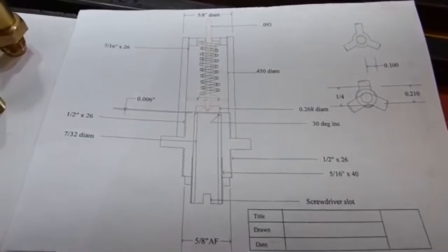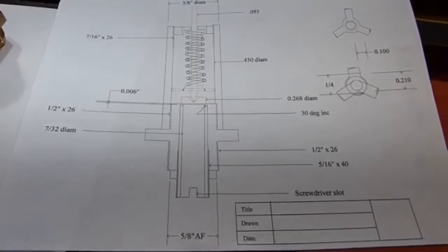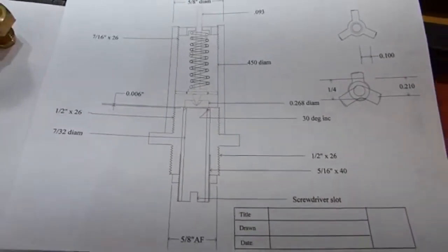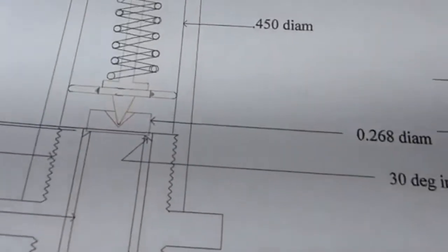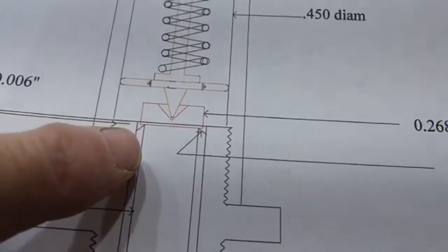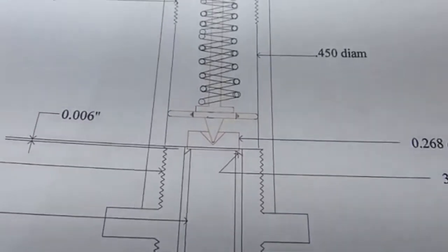This is a drawing I made based on the one by Jim Ewing in Engineering in Miniature. All I did was upscale it for 7¼ inch gauge — this particular drawing is for 5 inch gauge but I upscaled mine for 7¼ inch. There's the detail of the flat valve and the recess, which must be adjusted. This tiny little recess on top of the cone is approximately 6 thou, and it's fairly critical — it makes a real difference when adjusting the valve.